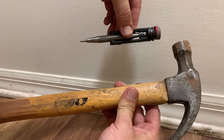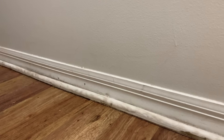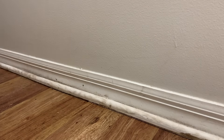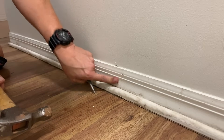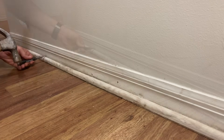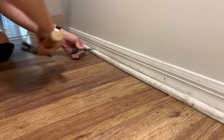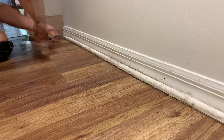There's also an old school method with a hammer. This is an old-fashioned nail set — actually a newer version of one — but most people have these laying around or they're easily accessible, and they're cheaper than the spring-loaded one. It works just like that: put it on the nail head, tap tap with the hammer, and it's set. We're just working our way all the way down setting all the nails.